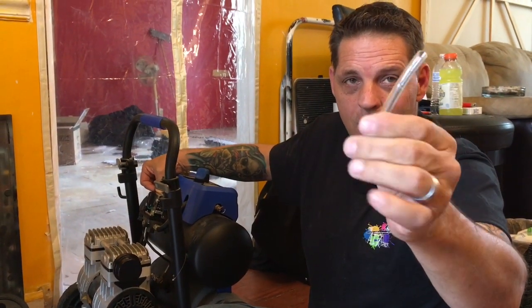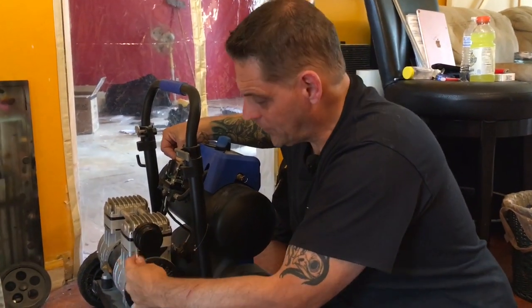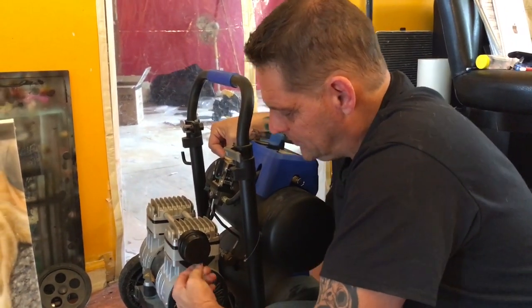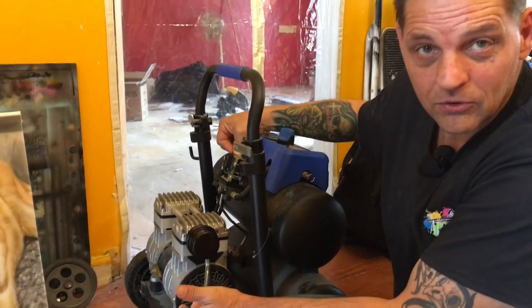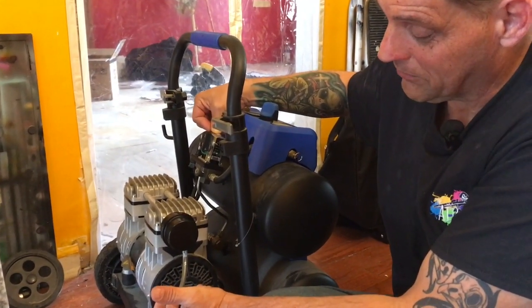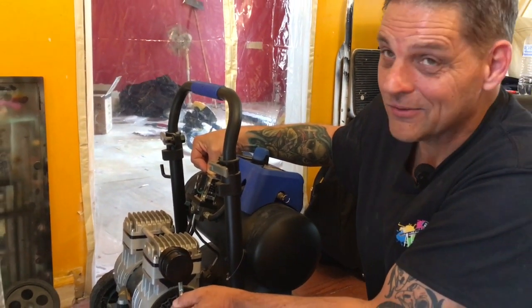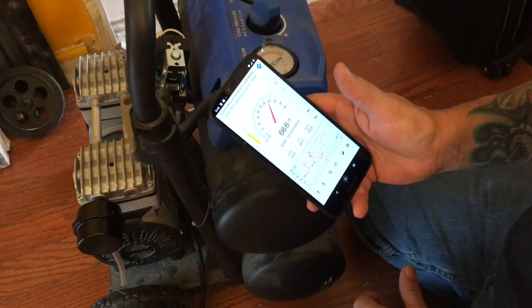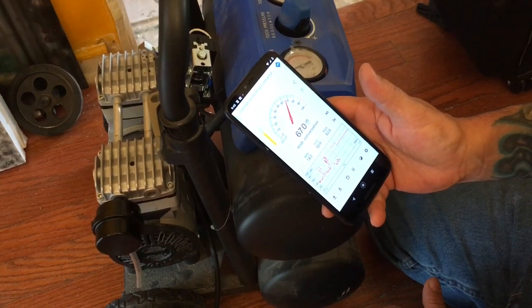Secondly, your compressor may have had one of these hoses. Most likely it did — there's a hole, and this hose should go in here. When you put this hose inside that, that little hose right there makes a significant difference in the sound level coming out of this compressor. Even better, bonus points: if you can attach a hose to a pipe and run it outside, you won't hardly hear any noise from the air going into the compressor. After changing my filter and putting the hose on, this is going to be my baseline — we're at about 65 to 67 decibels.